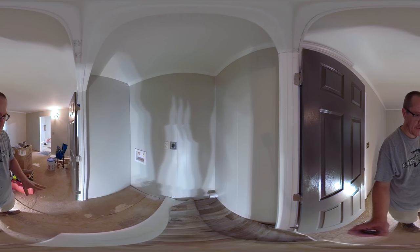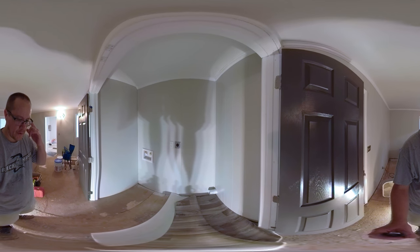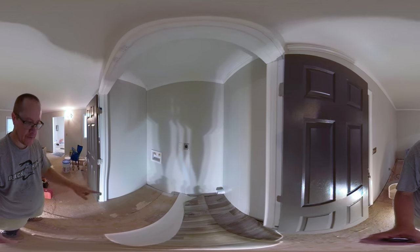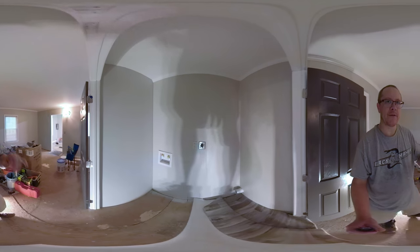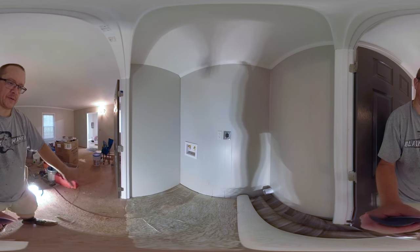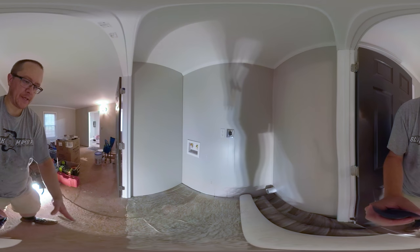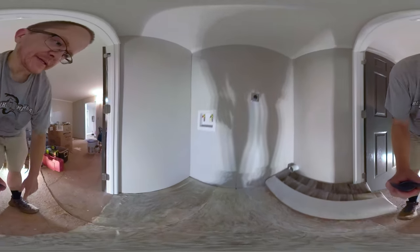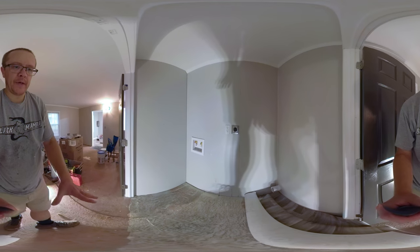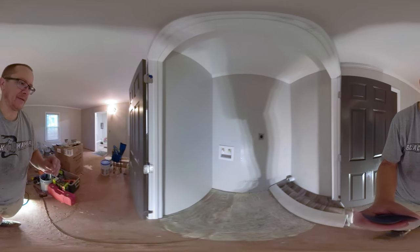Now that it's fitting in there, I'm going to lay some glue on half this room, roll it back down, smooth it out, pick up the other side, lay some more glue, then smooth that out. Then I'll come in and trim the edge so it lays down flat along the outside edges. You want to trowel the adhesive on like this and let it sit for a little bit — it's supposed to get kind of tacky, and then that's when you start to lay out the vinyl, moving it in smooth without any bubbles.